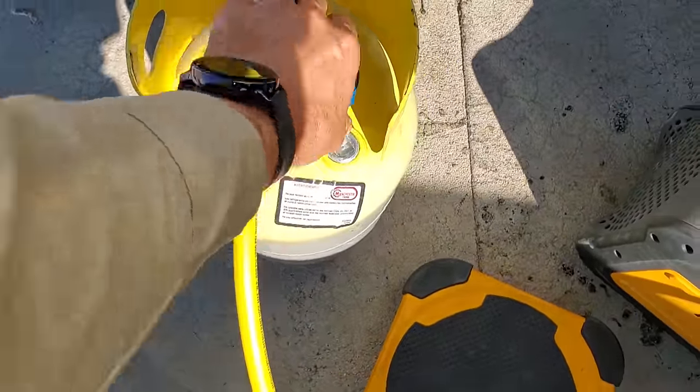I was pretty satisfied with where it decayed last time, but I went ahead and just let it pull down one more time. So we're pulling down again. It's at 550 right now. I'm getting everything ready to charge this unit up. I went back and forth, and I decided to go ahead and reuse the existing refrigerant.